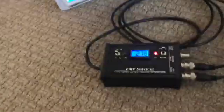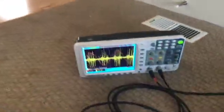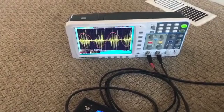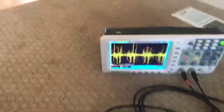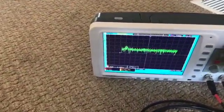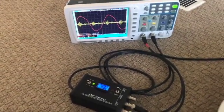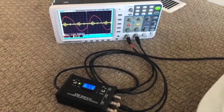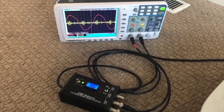We do not want that. Let's go back to the meter and turn it up. I'm on the lowest speed — now I'm going to turn it up to about 50 and see if that changes anything. Still at three volts, still pretty much the same. A little bit more noise but overall, if the unit is on with this variable speed motor it makes noise like this — this is common. I'm going to turn it off because I don't want to keep getting blasted by this. That's a whole lot of noise that I don't want to be hanging out on for an extended period of time.